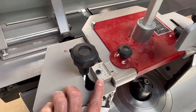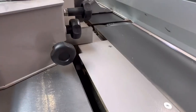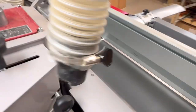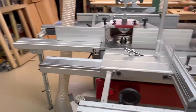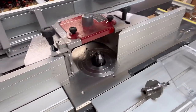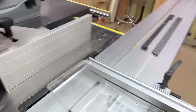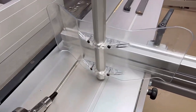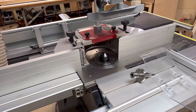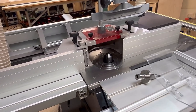The fence assembly is good. It has a micrometer adjustment on the outfeed side so you can balance it when you're taking a little off a piece as it comes through. There's also a micro adjustment in and out for the overall fence, which is a little tricky — you set it and can nudge it forward and back within a limited range, then you have to reset if it exceeds that. It comes with a guard assembly with a downpressure device and a clear safety guard that also acts as a pressure device to keep things against the fence. It absolutely handles coping stick operations on inch and three-quarter white oak with no power issues.